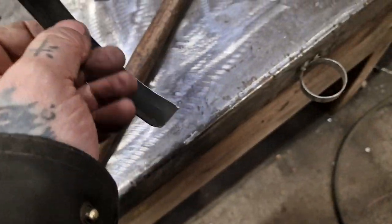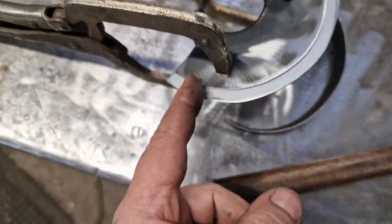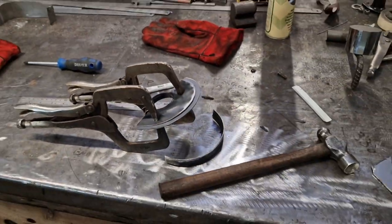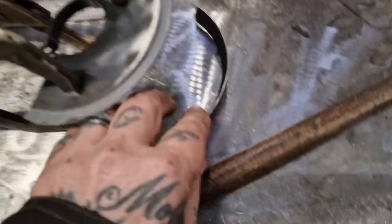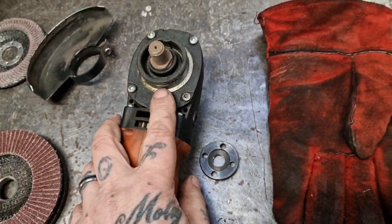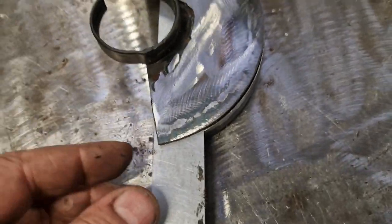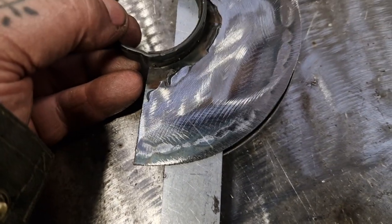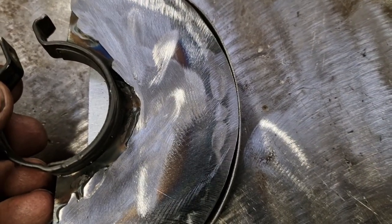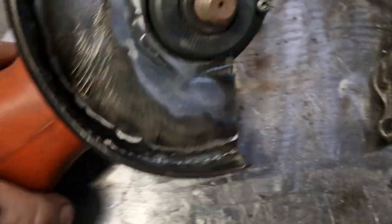There she blows - don't matter about that bit, don't have to follow anything. I'll get a few tacks on there, weld that up. And I even thought I can reuse the bit I cut off - just formed it, opened it out to fit. Sorry I'm not filming it very well. Where it comes short on the ends I've just cut the guard off. Don't matter, it's good enough. Happy days. So I'll get that tacked on, get that tacked on, give it a weld and a clean up. Hopefully after all that I can force this ring onto the collar here. I reckon it'll go. Now that that's done we can get this rim on - I'm just going to balance it on a rule to keep it from dropping inside and we'll get a tack on the centre there. Welded it up, cleaned up, and we're about there.